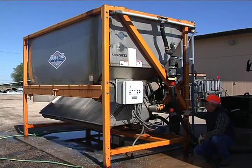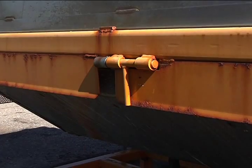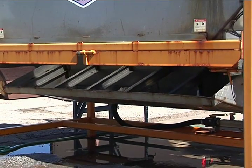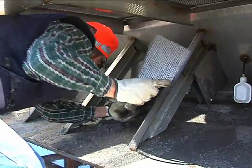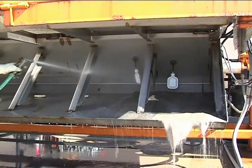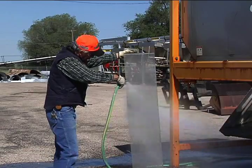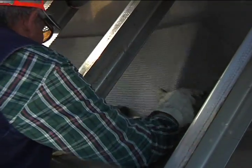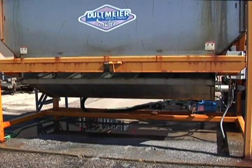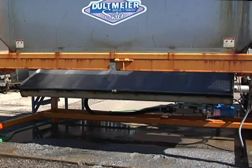Close the bottom tank and lock the trash screen. Lower the bottom tank and clean out the outlet screen and tank. All equipment used to make brine should be rinsed off with water to prevent corrosion. Raise the bottom tank again and unlock the trash screen. Then lower the bottom tank and trash screen to its storage position.